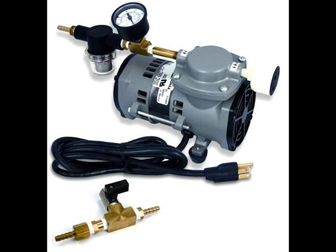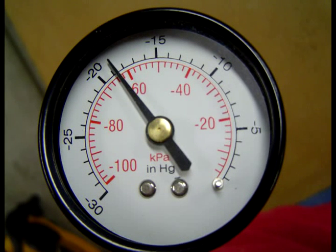How do I know how much clamping pressure I'm generating with my vacuum? Vacuum is normally measured in inches of mercury. You will need a gauge to measure how many inches of mercury your vacuum is pulling. With this information, we can calculate clamping or holding pressure. For example, my gauge now reads 19 inches of mercury.